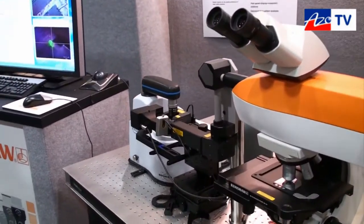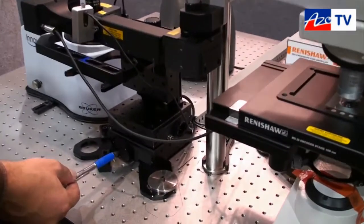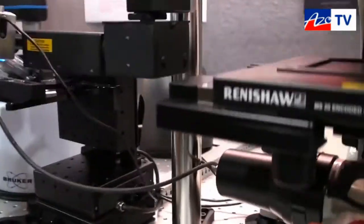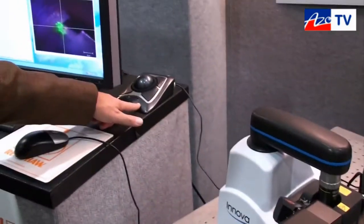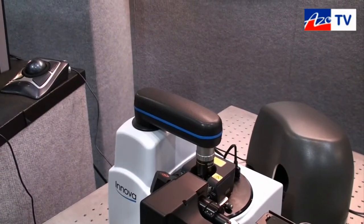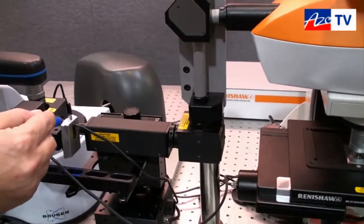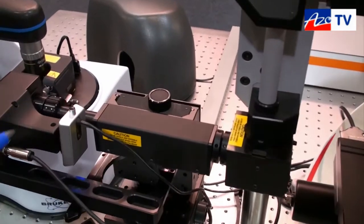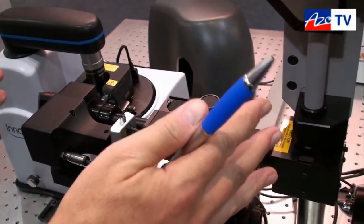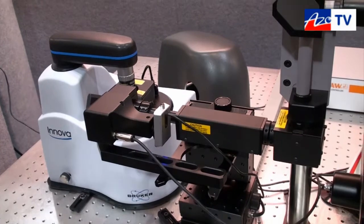Features in the arm we have here: we obviously have to be able to adjust the arm in three dimensions. We can adjust the arm in X, Y, and Z by means of a trackball, and we use that to manipulate the objective to position the laser beam onto the AFM tip. We are aided by a built-in CCD camera and a built-in light source. Other than the arm, both systems are completely independent and can be used as standalone systems.